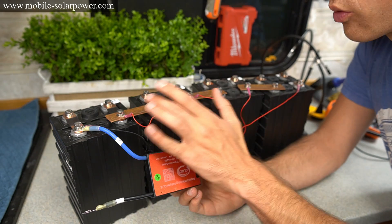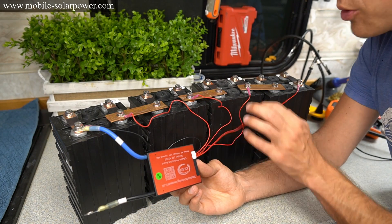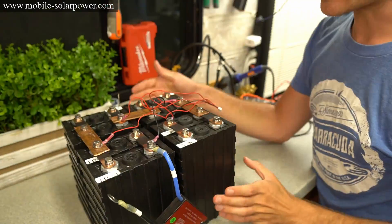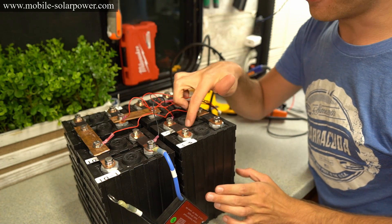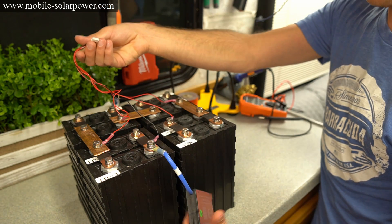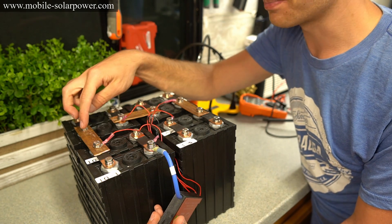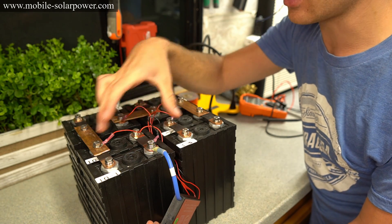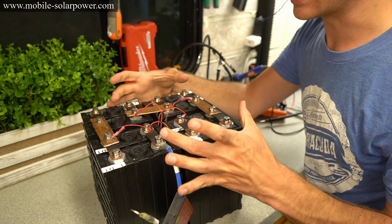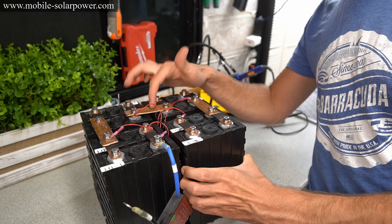It's nice to have the cells arranged this way so beginners can see the first, second, third, and fourth cell and add the BMS, but we need to rearrange these cells so they're not taking up so much space — this is not a logically configured battery pack. After rearranging, we have the main positive and main negative, plus the balance cable attached to all the cells, so we can plug it in and the system is activated. If you're building this pack at home, you want all cells close together with the bus bars they come with; if your battery doesn't come with enough bus bars, you'll need to order or make extra ones.